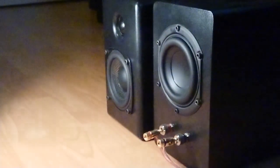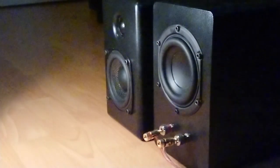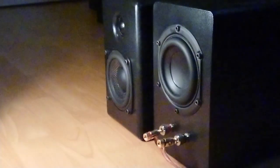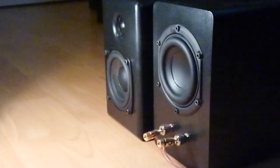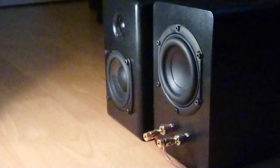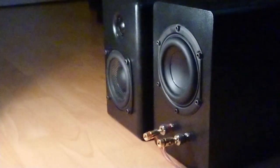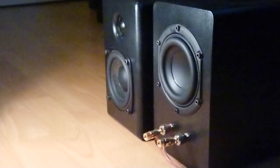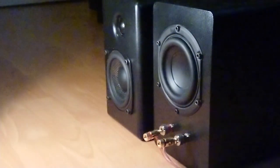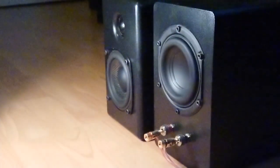When the diaphragm of the active driver moves inwards, it compresses the air inside the enclosure. This will push out the suspended mass, which is the diaphragm of the passive radiator. This mass has its inertia though, so it takes some time to get it to move or change the direction of the movement. By the right combination of parameters like enclosure volume and the weight of the moving mass, at the right frequency you'll achieve that both active and passive diaphragms move inwards and outwards in phase.